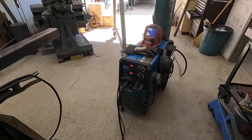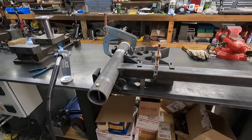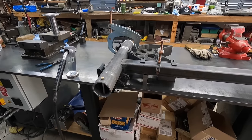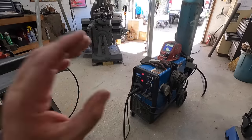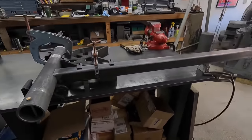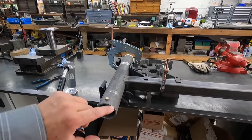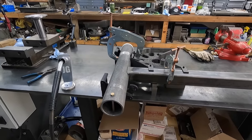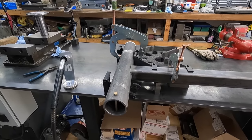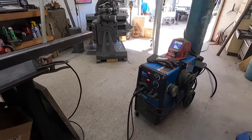And having a lot of people telling me that sometimes the little worm tracks you get is a result of having the voltage too high. But I like to adjust this dual shield on this machine to where you can visually see it and you can just hear it. It just hums while you're pouring metal to it right there. So we lowered a little bit, but we're just gonna try that and it'll probably weld out fine in that position right there, or those parameters anyway.